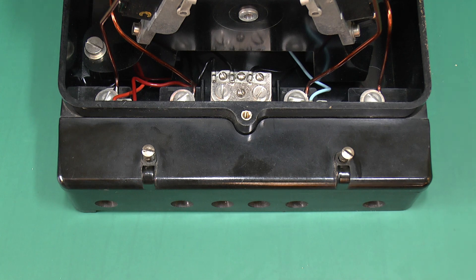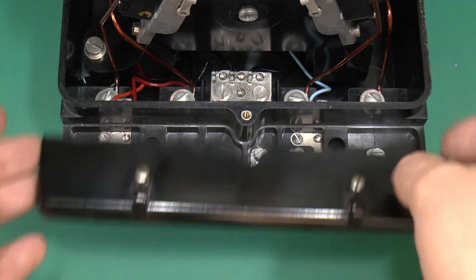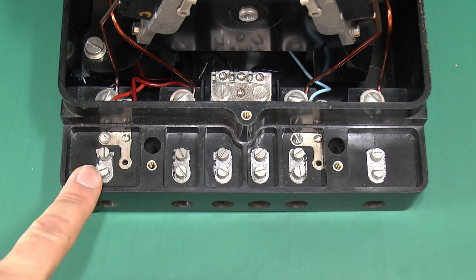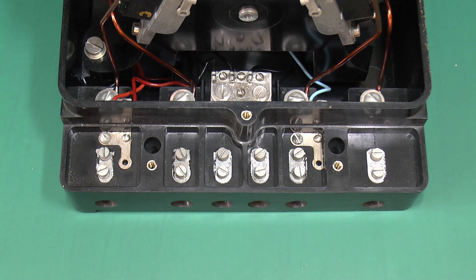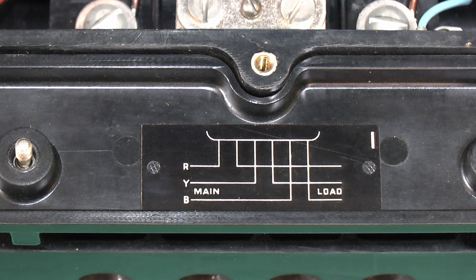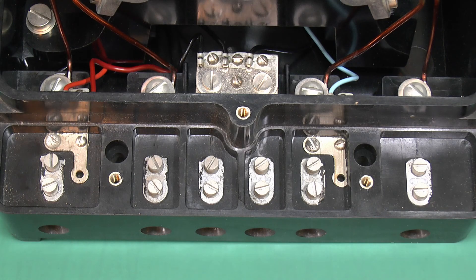Connections to this meter are pretty standard, just under the two screws. There are six terminals — two for each phase. So in and out, in and out, in and out in that order. On the back of the cover there's a little diagram showing the wiring layout, marked red, yellow and blue as would be the case in the 1960s — or sometimes red, white and blue. Terminals are fairly substantial with two screws for each, and cables would just enter in the bottom holes.